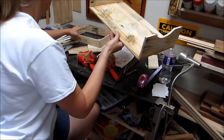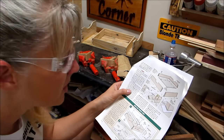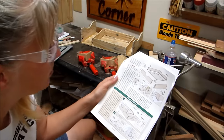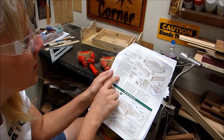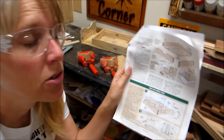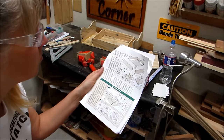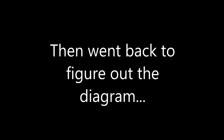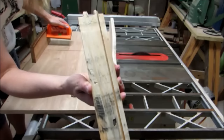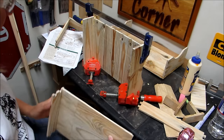The bottom is done. The instructions say I need to make a complicated connection for the drawer bottom — a quarter-inch thick plywood or pallet wood bottom, rabbited on the edges to leave a one-eighth inch tongue to fit the grooves. I wasn't sure how to do that successfully, so I glued the shelf together first and then went back to figure out the diagram. I cut the rabbet and then cut the slots in the sides, and it looked okay — kind of like the picture. I got it!